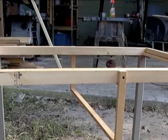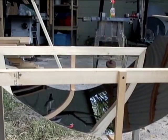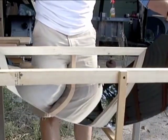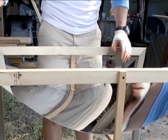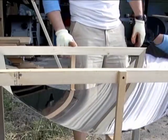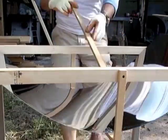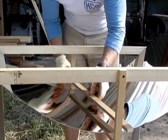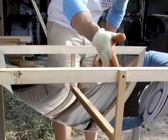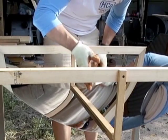Now that we have this, all we have to do is take our mirror, drop it into place, and that's going to hold it there. You want to make sure to measure these and make sure the ends are even so your mirror is lined up on both sides. This is going to be a relatively deep drop — it's probably going to put a focal point right about here. You can put holes in these brackets here and raise or lower it if you want to make it adjustable. I'm just going to screw this down and pinch this together to hold it. You're probably thinking you're going to lose that center part — it doesn't really matter because your target is going to be right here, and that's going to be blocking the sunlight coming in anyway.